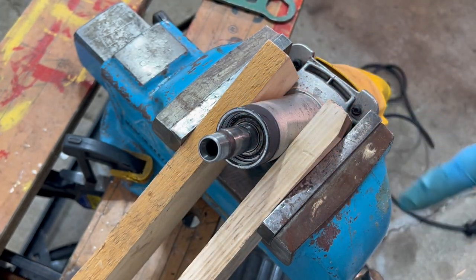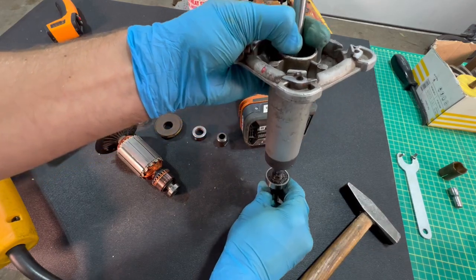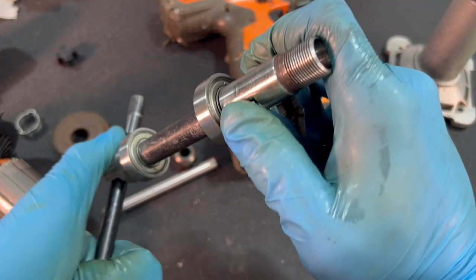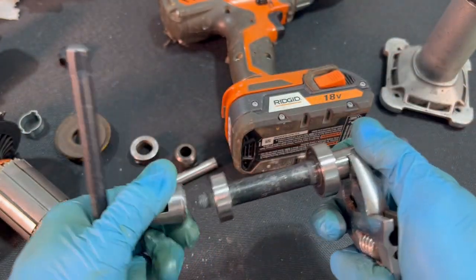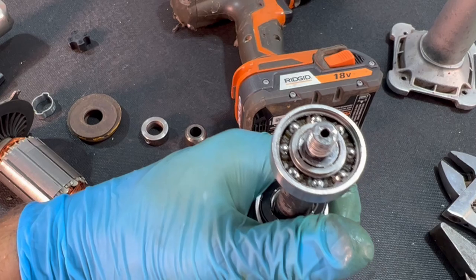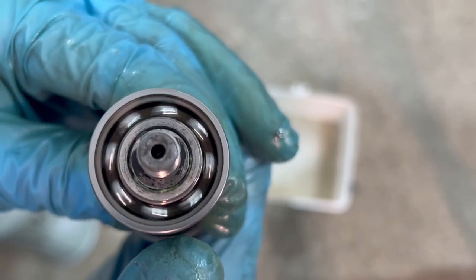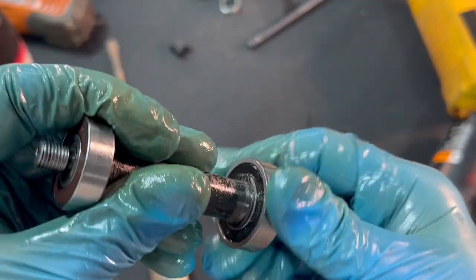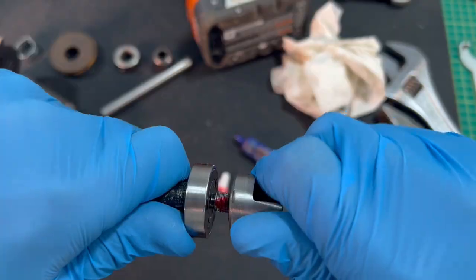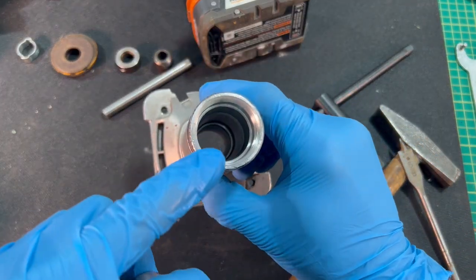I just have to figure out how to get those bearings out. I just need to take off this little coupler piece. Because they're not in horrific shape — they could use some new grease — I'm going to clean them out first and then re-grease them, put the shields back on and get everything back together. I'll clean the end with some alcohol to make sure all the grease is off, then reapply some thread locker. I'm pretty sure the original had thread locker on it — it was a little crusty coming off. And back into a clean bearing housing.